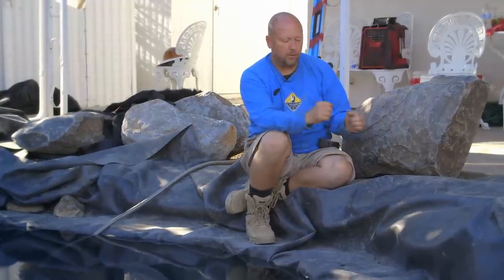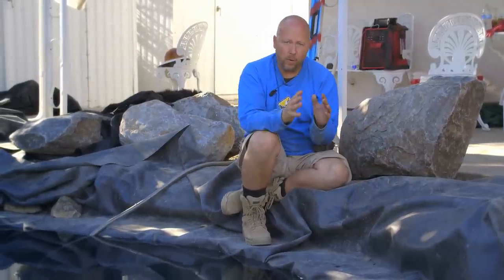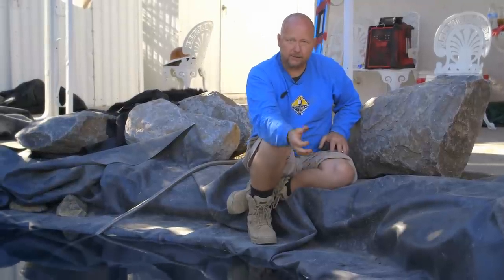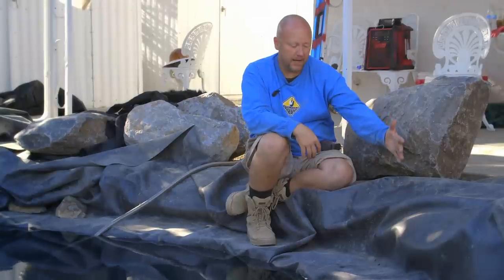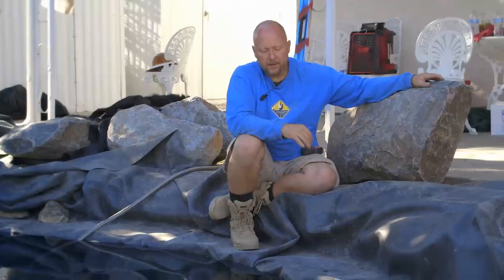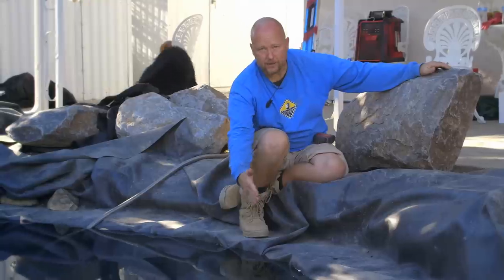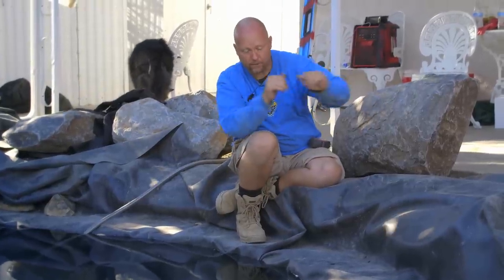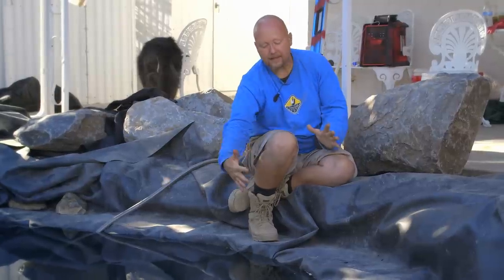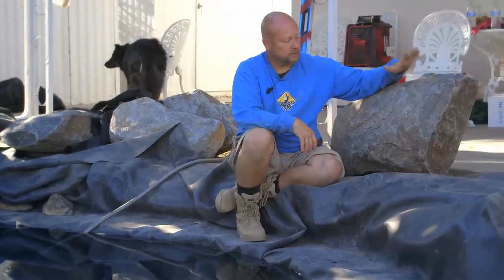What we're going to have to do is peel back the liner a little bit and carve into this outer shelf. The weight of the rock is still going to be sitting on the bond beam, giving us all that support. So we can sculpt the back edge of the excavation to fit the rock, and then do our backfill. We really want the rock work to be barely past the coping stone — almost like it's hanging over a little bit. We've chosen some big, fat, hefty rocks so we can get that overhang and still have a nice sturdy coping stone.